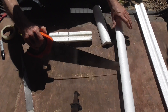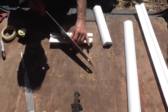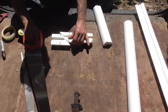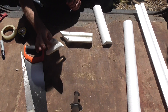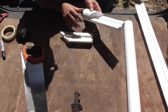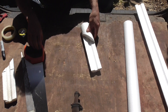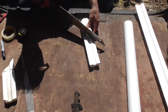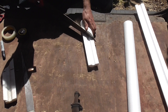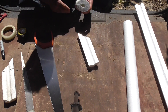So all we need to do is take our insulation saw and just cut across the diameter like that. We don't force anything, we just do a straight slow cut until we're through. And then the piece that we measured, we take that, put them together like this, making sure it's flush on the back and flush on the sides, and then you just cut across the face like that. No forcing, just let the saw do the work and then we're through. And as you can see with an insulation saw you get no mess.